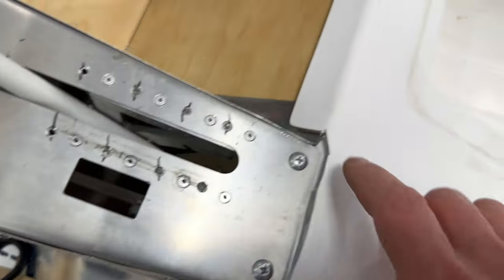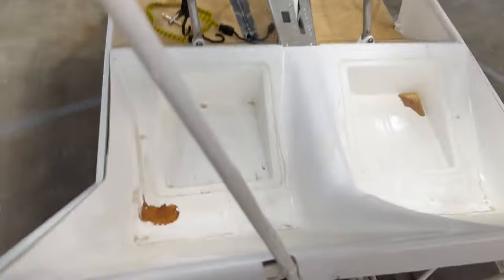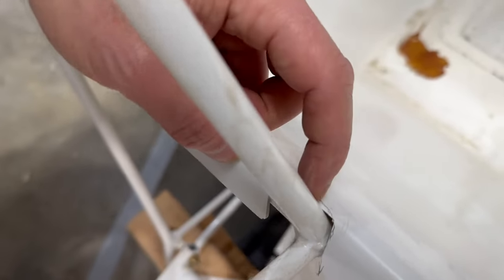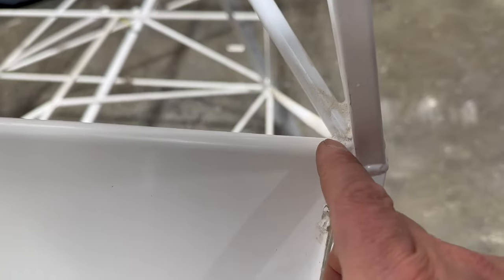All right, it's in. So, fit and finish. Right now I'm looking pretty good on my marks here. This one, a little wide, but what do you do? These are the larger gaps. Anyway, I'll sand that out a little bit, and it is hitting up here on the top, in the front, down this way. You can see, once we put a little pressure on it, so I'll sand that out, because sanding is pretty easy and I can make a nice radius with my finger and some sandpaper. And I'm hitting that weld there. But for now it's in.